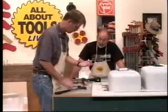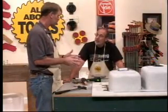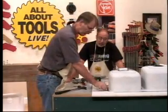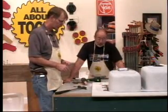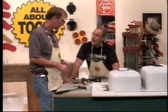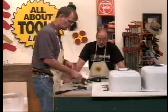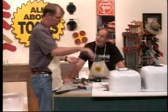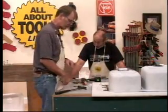Now, how long does that take to set? Between 5 and 10 minutes, it's going to be at 50% of its permanent strength. It's an acrylic adhesive. In about an hour, I'm going to have reached 90%. Now, at 50%, could I go ahead and put a silicone bead on this, lay this down, and snug it up? Certainly. It's pretty fast. You're going to spend about 5 minutes just getting these things on. By the time you get it off, clean the rim, and re-clean the area, you're probably going to be at about 10 minutes, which is all the time to put these things on at all.